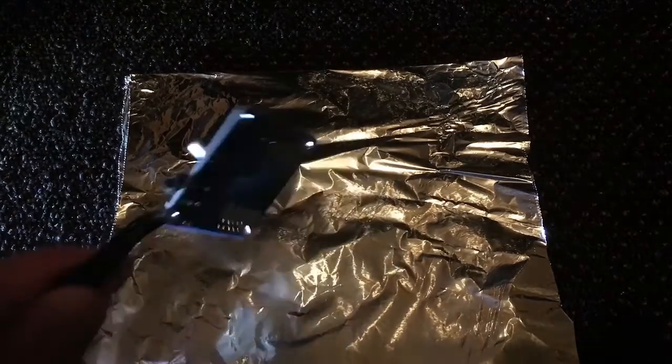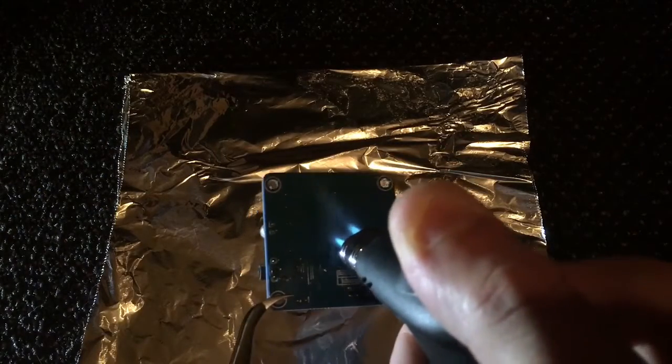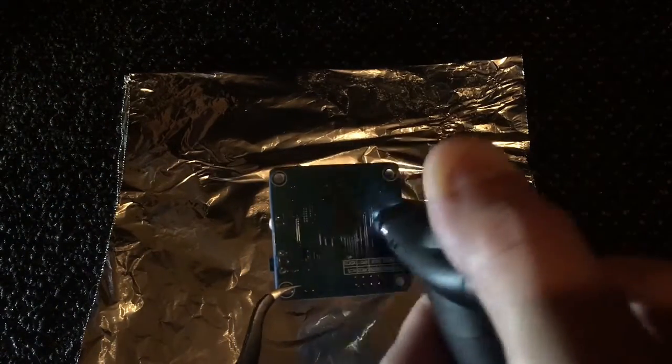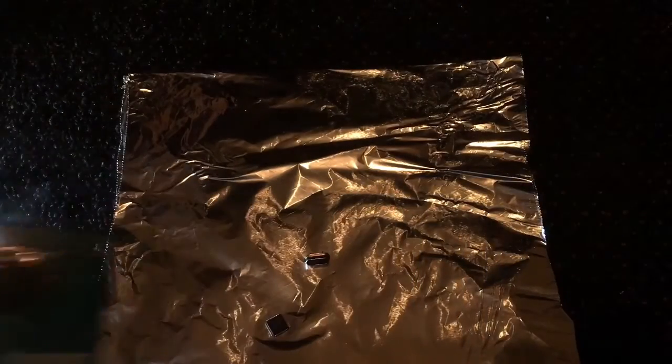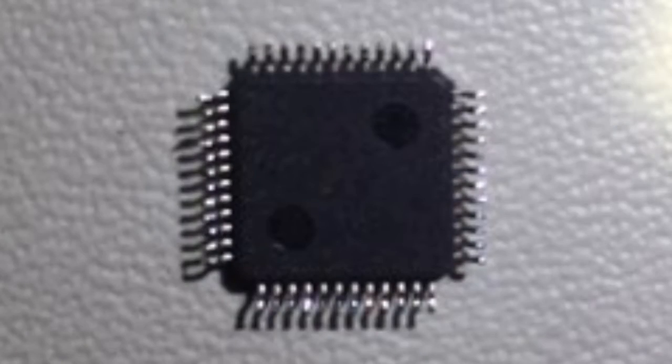Presuming I don't care about the actual board — if the chip's light enough it'll never come off because the surface tension of the wet solder will keep it there, so there's a time to start tapping the board. I have to drive for an hour to access real SMD stations, so this will have to do.